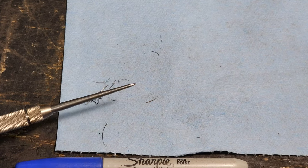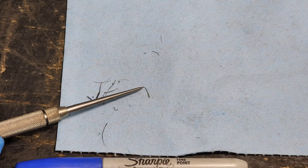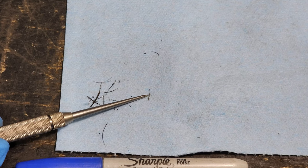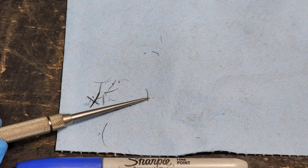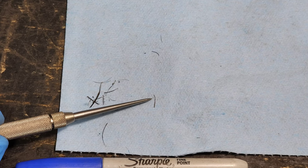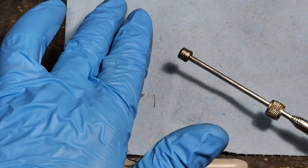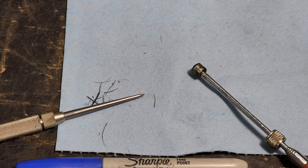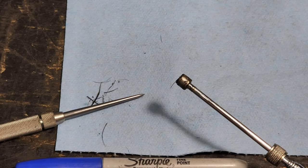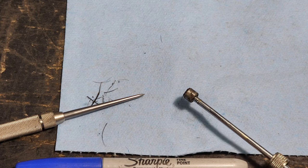Let's talk safety really quick. This is a handful of metal chips that come off my mill — as you can see, they're pretty tiny. One day I was running the mill and a chip flew off, hit the underside of my baseball cap, and then bounced down behind my safety glasses and landed in the bottom eyelid between my eyeball and eyelid. It was deep enough that I couldn't get it out. The way I got it out was I grabbed a small magnet, put it in the finger of a clean nitrile glove, and stuck that in my eye — and was luckily able to capture that chip. If this was not a magnetic material, say aluminum, I would have been taking a trip to the ER. Just be aware that you can do everything right safety-wise and still get hurt with one of these machines.